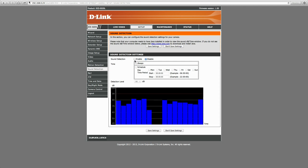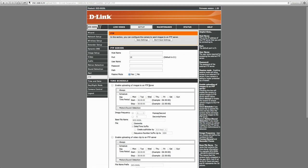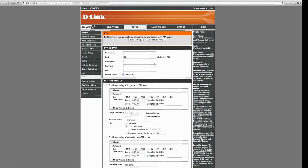You can set the level of sound detection you want it to respond to. If someone's breaking in, you might hear around 60 decibels, and if it detects that it can send you an email or a video file of what it's seeing. It can also FTP images to a web server, sending an image or video file up there. This does not require the D-Link service, so you can set this up completely on your own. The camera is also completely password protected — you set the password when you first configure it, either through their internal software or the web control panel, so even if the camera is exposed to the web, people who stumble upon it won't be able to get in without the password.